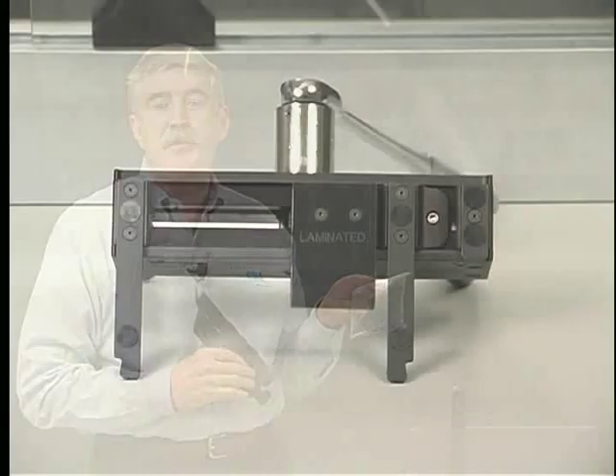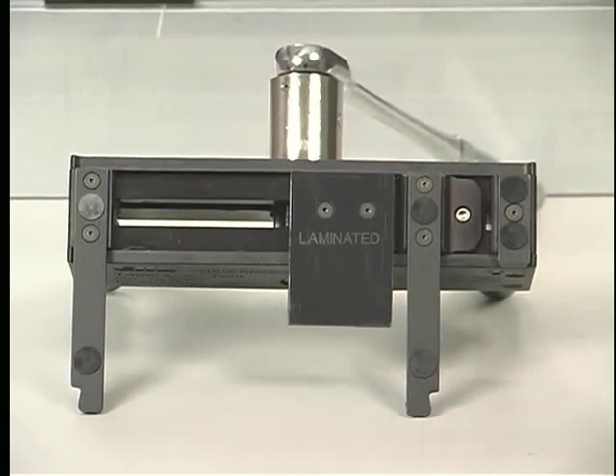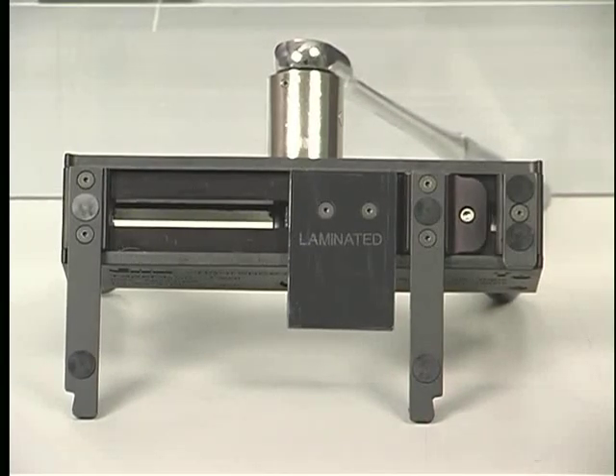This is our TLB 6R blade set. It comes with each one of your tool kits, and you'll see two different push blocks inside the package — one says 'laminated' across the top, and that's the one you want to use with the new laminated taper. The laminated taper is a different design, made to meet all the laminated glass tolerances. It meets the ASTM, BSI, and DIN tolerance standards.